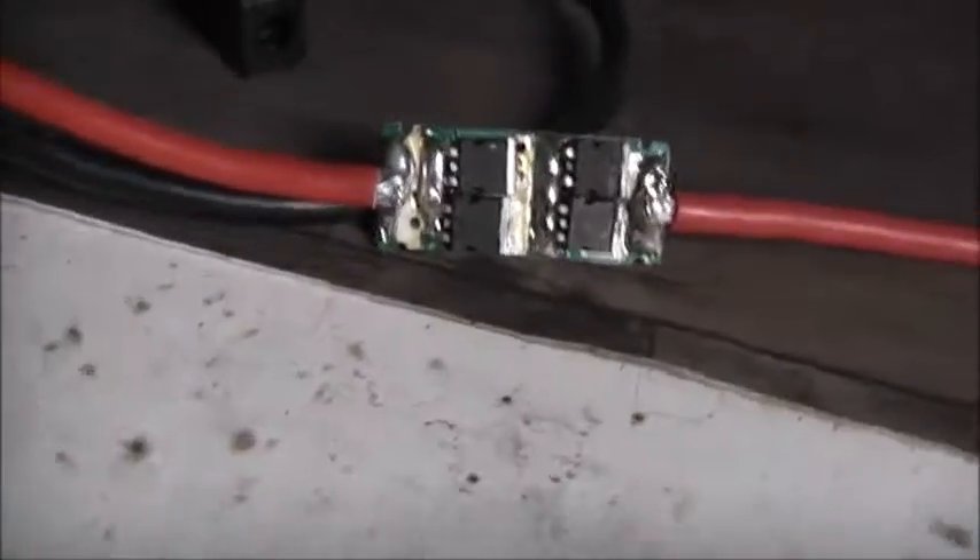Let's get the challenge of soldering these, because this is such a wide area. This whole bit here is all going to act like kind of a heat sink, especially the backs of these Schottky diodes - there's a wide area I have to heat up to get that to stick. This is where you want a big soldering iron, which is what I've got.